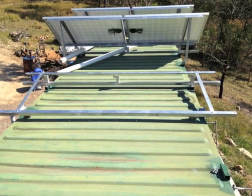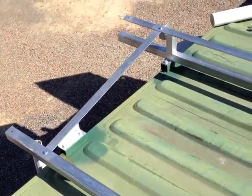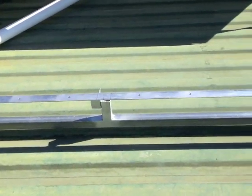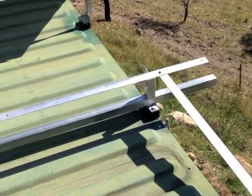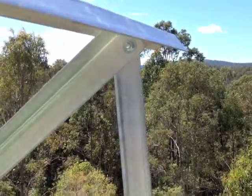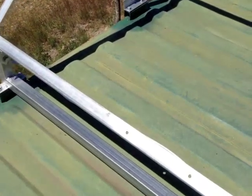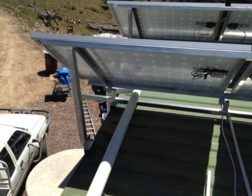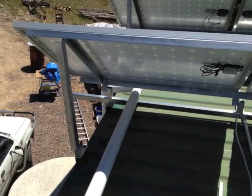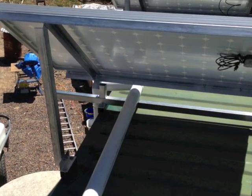And then I put on the rest of the frame. There are manufacturer's holes on the back of the solar panels, so I pre-drilled the wide battens to match these holes. I bolt in the upright support, and here's the frame up at an angle. The gap between the crossmember and the bottom of the solar panel I've made big enough so that I can put a stormwater pipe. There's enough height clearance to allow me to create a tilt downwards over the length of the container.